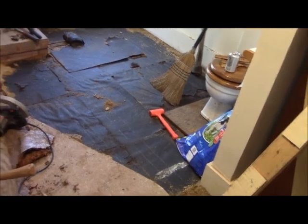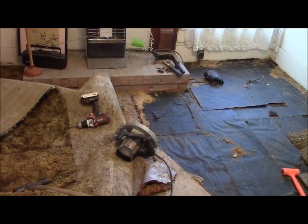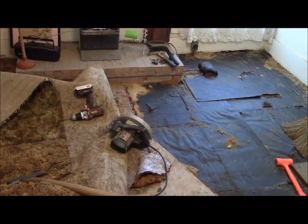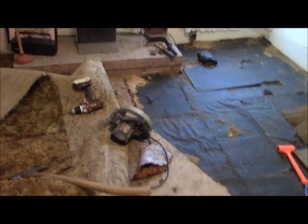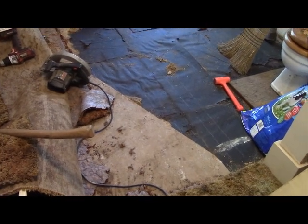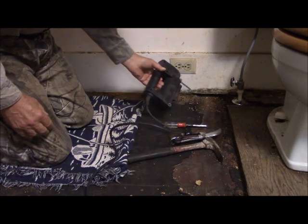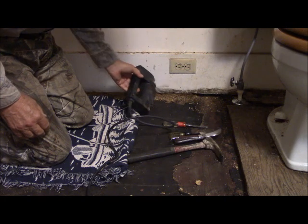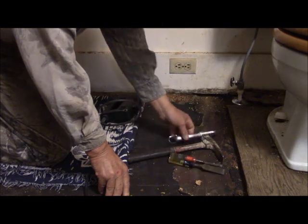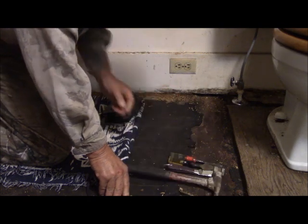As well as this paper to lift, and I want to take my care with that. I'm also going to have to finish up down there next to the hearth, and cut that press board a little bit, partially with the saw as I did before, and partially with the chisel to get that out and clean up these edges so when I cut my press board I have clean edge-to-edge fits. I'm going to use this Black & Decker jigsaw to cut along this part.